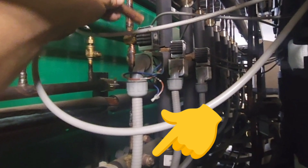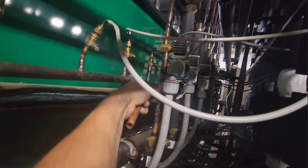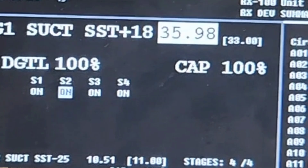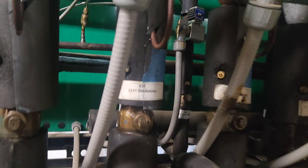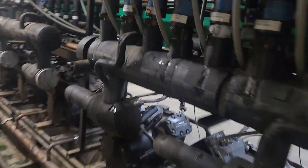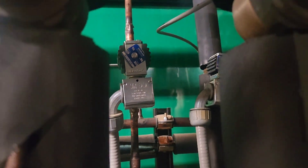I installed them both to pump down this circuit. Not only do we have to close the liquid line ball valve, but if you look closely at the EPR you'll see a hose coming into it — that's high pressure from the discharge header that lays behind the liquid line header, and it must be closed too. Then once the circuit has suction header pressure on both the liquid line and suction line — in this case around 35 to 36 psi — we close the suction ball valve and remove the remaining pressure to work on replacing the solenoid. Here's the old one after I took it out. I like to keep my parts tags in my back pocket — it helps at the end when I'm doing my invoicing. Here's the new 5/8" solenoid valve installed with the MKC2 coil. It doesn't look pretty, but it'll work.